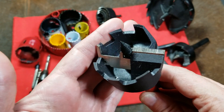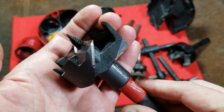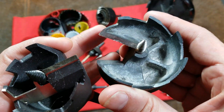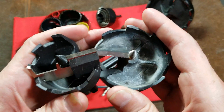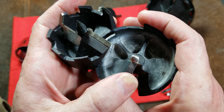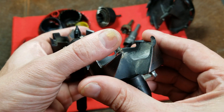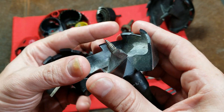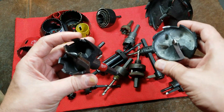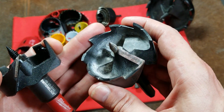Self-feed bits, such as this Milwaukee Switchblade — a more modern design — have a high-speed steel interchangeable cutter. These cutters are actually known as chip lifters, because the little cutting edges are higher by about a sixteenth of an inch from the body. These cut around the edge and then basically lift out the center of the wood. They are the most effective and longest lasting for drilling holes in wood, just because of how heavy duty the bit is and how it can be repeatedly resharpened.